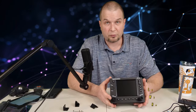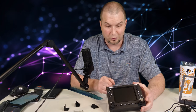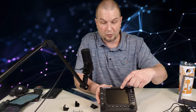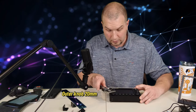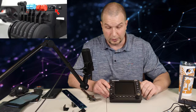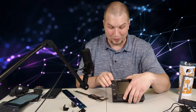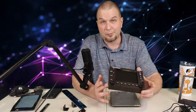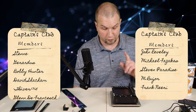Now I want to take some measurements. As far as the visible screen dimensions — and I say visible because there could be some screen behind the bezel — from side to side the bezel is 4 inches, and from top bezel to bottom bezel is 3 inches. The bottom encoder knob is 20 millimeters in diameter and the inner knob is 14 millimeters in diameter. For comparison, the Bravo throttle quadrant rotary knob is also 14 millimeters in diameter — the same size as the inner encoder knob on the 530. From the bottom of the knob to the top is 25 millimeters. Throwing it on the scale, we're at 420 grams or 14.8 ounces — very close to one pound.